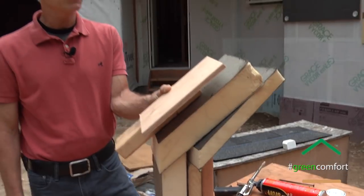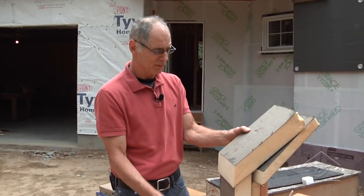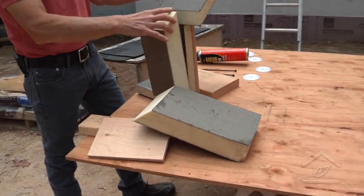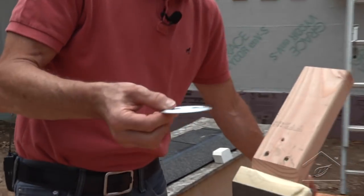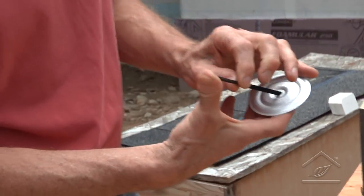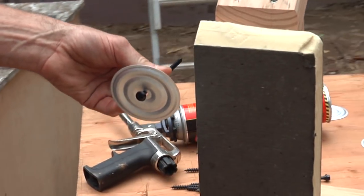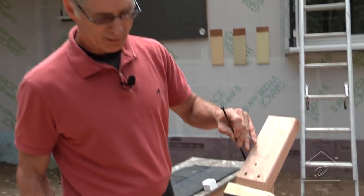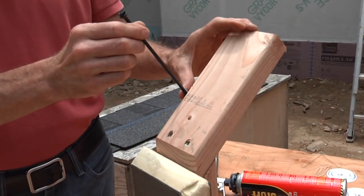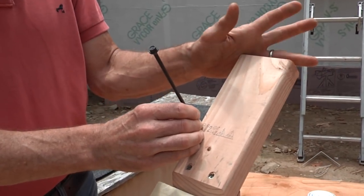I wanted to show how the layers alternate and how we attach things. We use clips and screws to hold everything in place — even with the thick insulation we can pull fasteners all the way into the framing. On the roof, where we're getting the sleepers in, we have the added thickness of the 2x4 plus the insulation, so a long screw gets in there and catches the rafters for a really good bite.